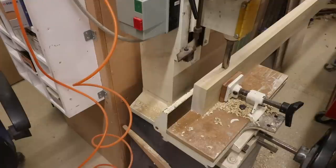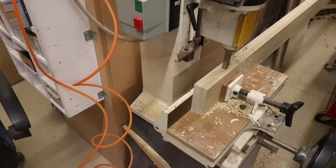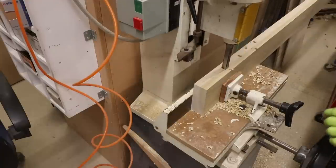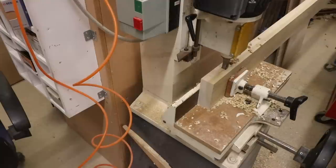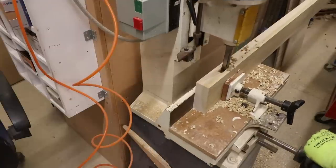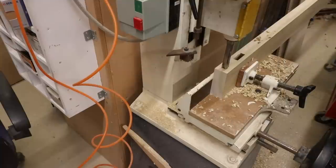This side, we're going to cut the tenon through at that same through setting, and then we're going to cut the haunch at the haunch setting. So you can see that's gone through the piece of timber and out through into the other cut. So it goes through about there, and you just want a bit of extra room for that timber to clear. And for the haunch, you're just at that position, and that will stop the chisel at the haunch step.